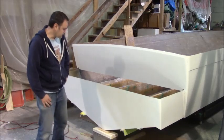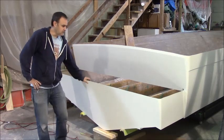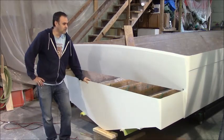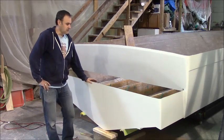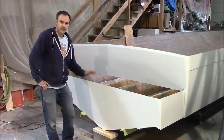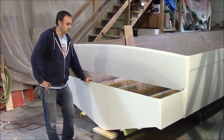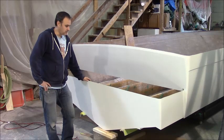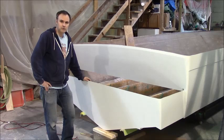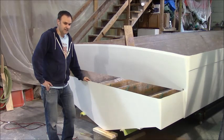That is essentially the end of the hull extension. The improvements you'll see over the shorter length: the boat will track better, it will get up on plane easier, the boat can hold more weight inside, and it will ride a little flatter. So that's quite a few improvements — but definitely not a small task to do. Thanks for watching.